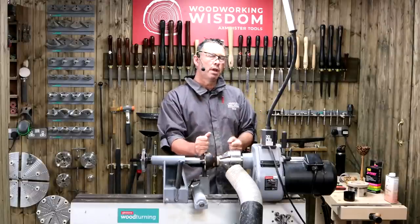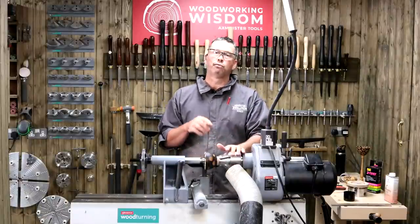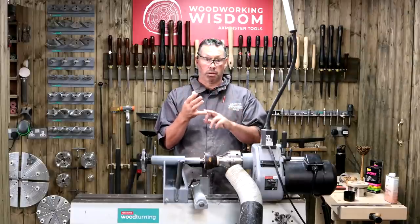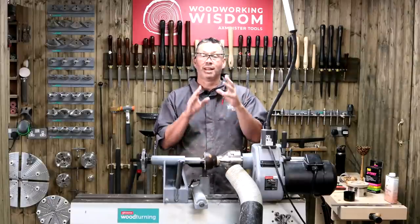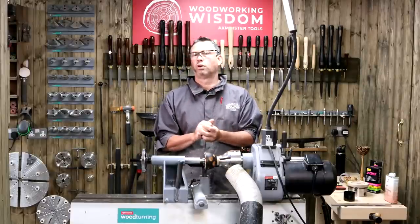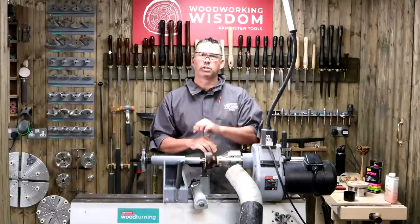So epoxy resin, this particular epoxy resin is the Ecopoxy, but there's lots of resins that are intended for casting, epoxy resins, and they're definitely the ones to go for this type of job. We need that strength, that structural strength. If it's just making pens, polyester resin is fine, but for this sort of thing, it's epoxy all the time.